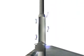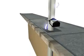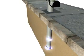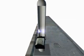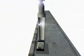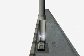A coil is placed around a streetlight and a current passed through it. This induces eddy currents in the metal that flow to the very root of the column. The magnetic fields created by the eddy currents travel down the outside of the column in what's known as the skin effect, and through the metal — the remote field. The time it takes for the magnetic fields to travel through the metal is measured as a phase shift by a probe. The amount of phase shift depends on the thickness of the metal and its permeability.